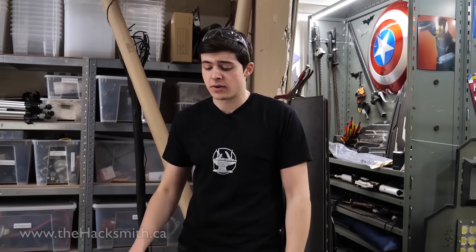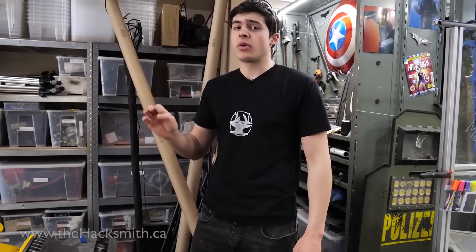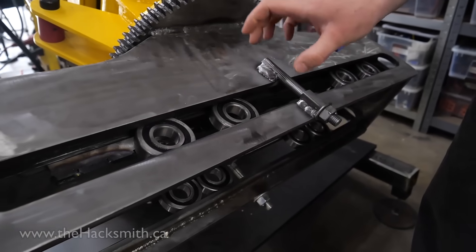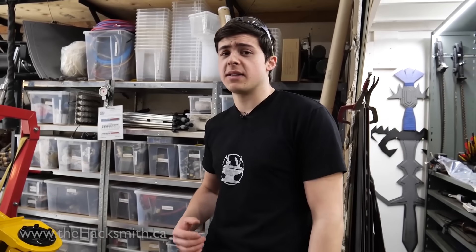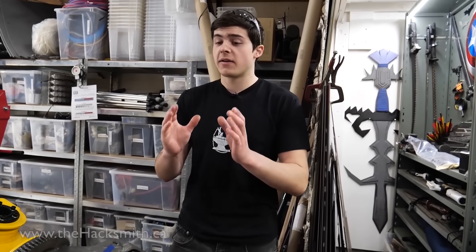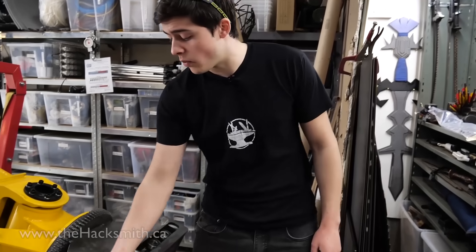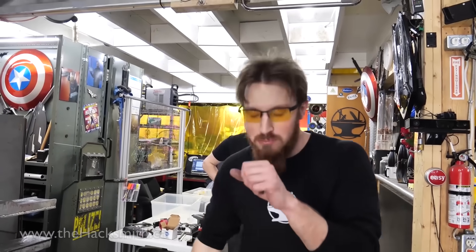As you may have noticed during our initial testing of the gripper, you saw a little bit of flex in the actual fingers. We anticipated that, but there was a lot more than we were hoping for. What ended up happening is during the welding of the railing to the side plate, the actual rail warped a little bit, giving us more space in the middle which causes that huge deflection you see in the grippers. So what we've done to mitigate that is we've actually added tie rods on either end of the gripper. Theoretically with this new design, the bearings move very little and the gripper will not have the same amount of flex. In the second hand, we'll also be leaving a bit of material in the middle — instead of one big slot, there will be two smaller ones, ensuring the steel cannot flex or warp in the middle.